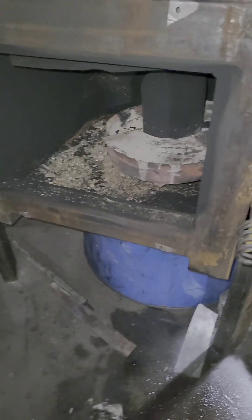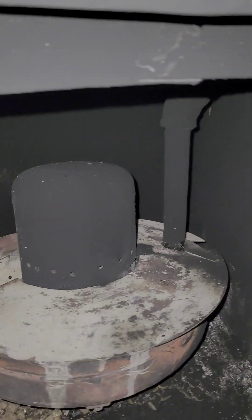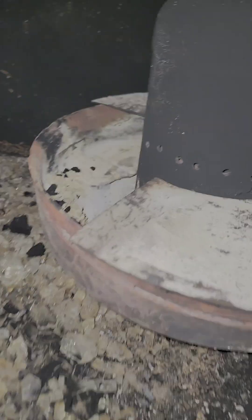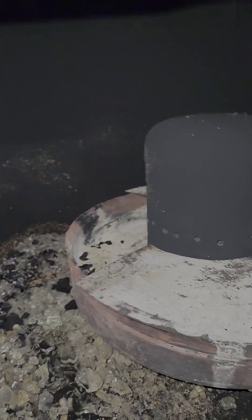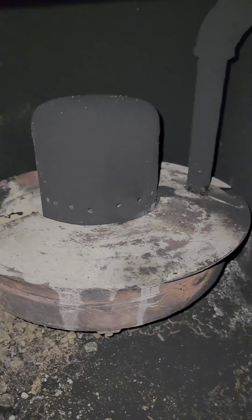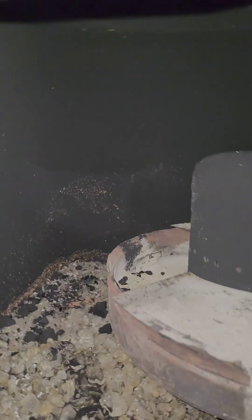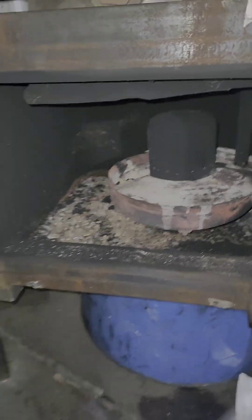I built a latch from a Mercedes hood latch. This is my latest burn pot — I was always having too much fire licking up around the fuel intake, so I sealed the burn pot up except for about a third of it. The majority of the fire blows through and comes out over here, with air coming in throughout the whole thing. It keeps the fire intense rather than just flaming about. It burns pretty good — obviously there's some soot, but most of that happens during ignition and shutdown. That's pretty much it.